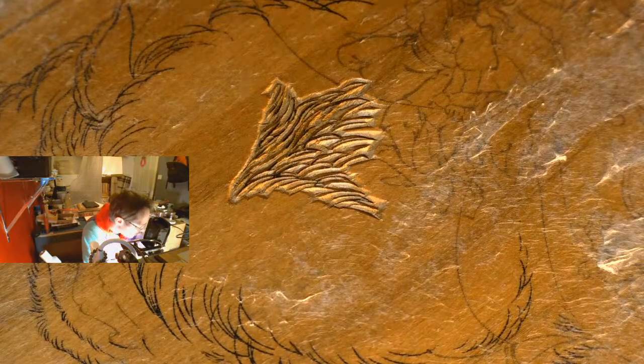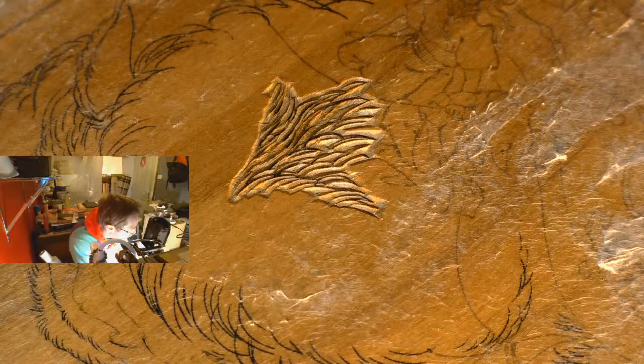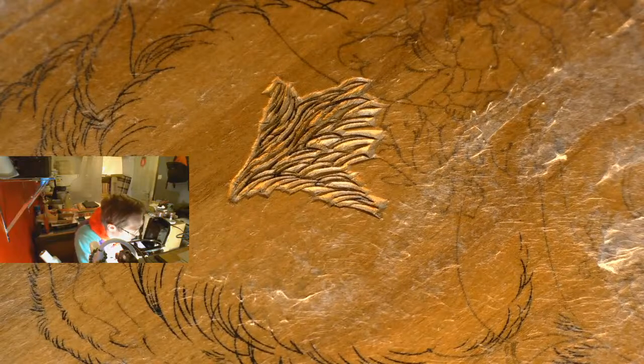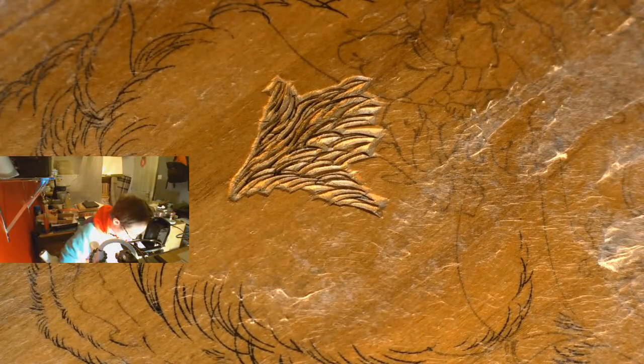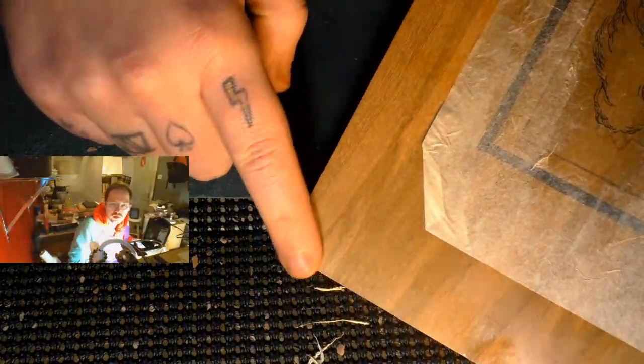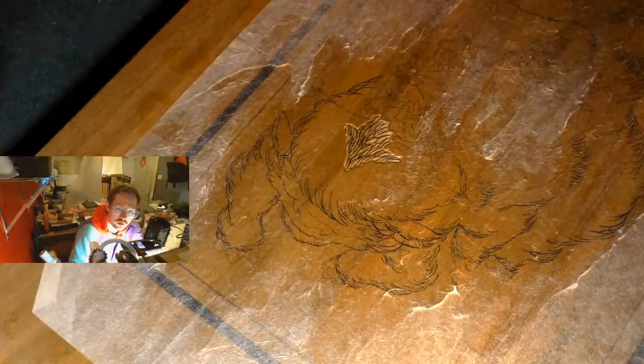Yeah, that could be the case. It's just at the point of anything above sort of 1000, I would say you're more just polishing the wood. You're not going to be actually sanding anything. It's more of a burnishing effect there, Kai. You're just giving it the smoothest sort of surface possible. So when you look at this, you can see sort of the shine in the wood. And these are wet sanded blocks from Japan. You can see the shine here. Not this bit because that's got glue, but in here you can see that shine, and that's sort of what you're looking for. That sort of burnished quality to the wood. And that's the purpose of using a really high grit sandpaper there.